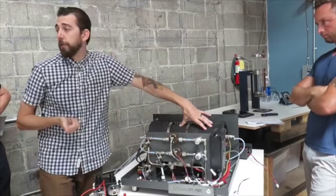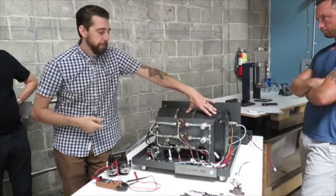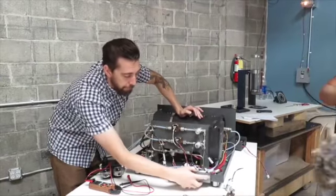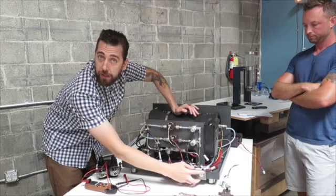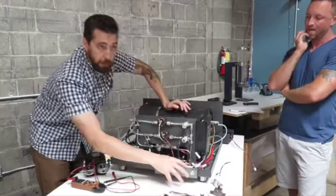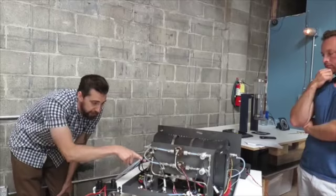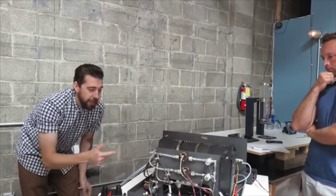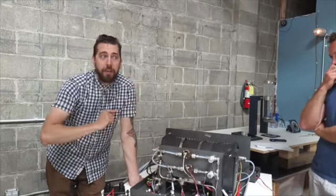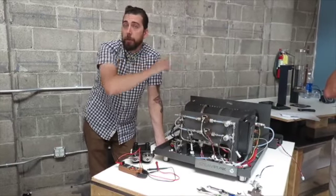Out of the back side of that, it's putting out 24 volt DC and various amperage depending on 2-group and 4-group machine. From that, it goes through the power button right here. Feeds right to this. So when you depress this button, that is what allows 24 volts through to other components to turn on. This contactor, if you look on the back side, has a smaller red and black wire, and that's what you'll hear click when you turn this on. It's an electromagnet that pops that up, and then now it's just a switch, allowing the higher voltage through into the other components on the machine.